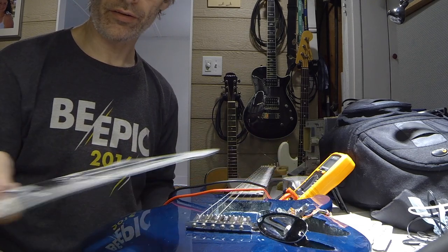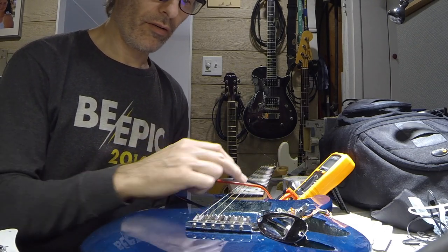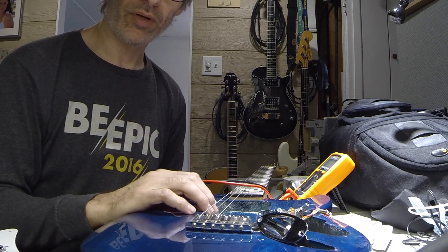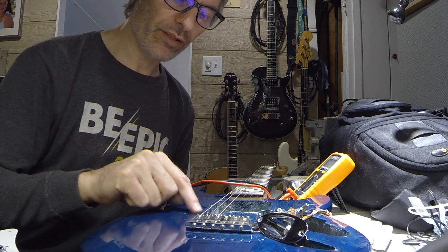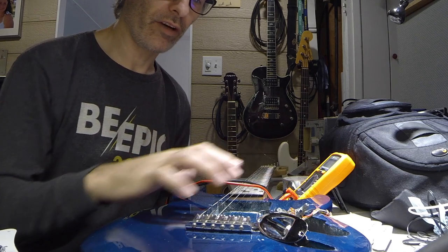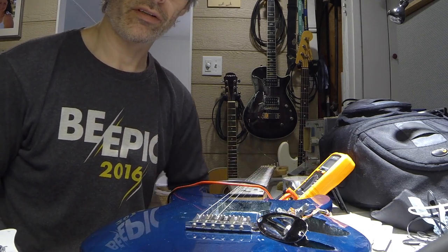The other thing you could do — and I've seen a lot of people do — is actually put tape throughout the cavity and make sure the cavity itself has a good bond the same way, then roll it up around the edges so that it makes contact with the pickguard. That will provide a good Faraday cage and full grounding, and you should eliminate that buzz.